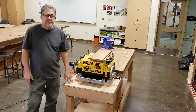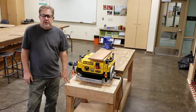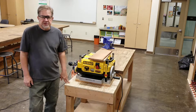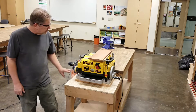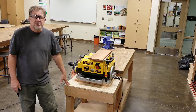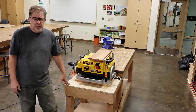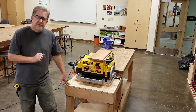Step number five: deal with the unexpected. You have a chance to be distracted and have a problem. If somebody comes up and taps you on the shoulder while you're using this machine, ignore them until you complete what you're doing, the machine is turned off, and you have your material in your hand. It's not worth it — just a moment of distraction will get you hurt. Most accidents in the shop have to do with complacency and dealing with a distraction.